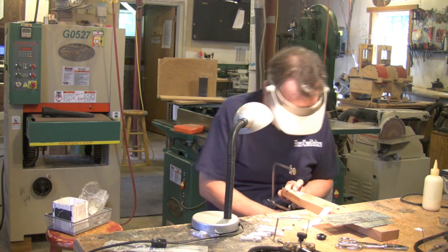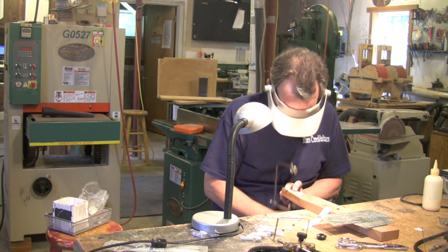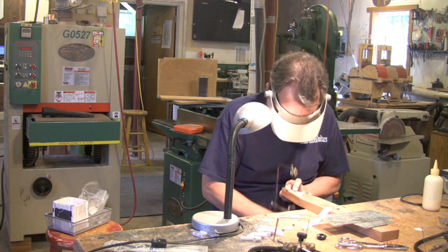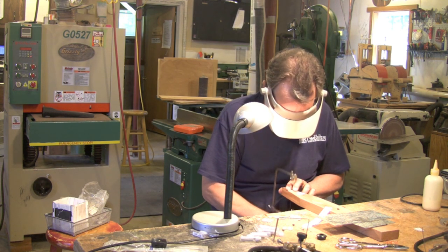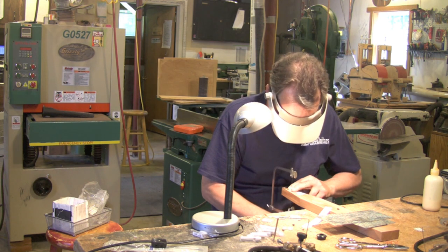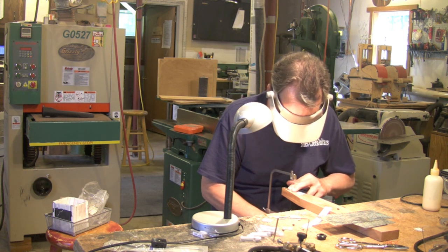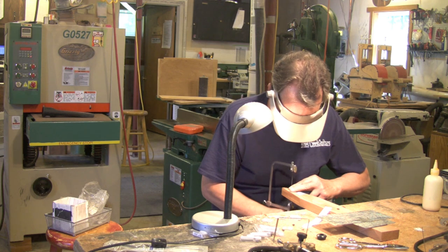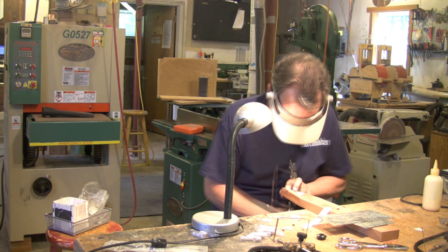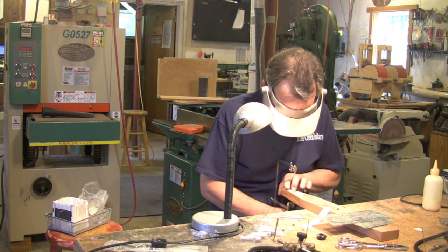If I get too much like this, I'm going to want to tilt my blade. I'm finding a good rhythm. The more you do this, you'll feel the blade working, and if you listen you can hear it cutting. Now there's a straight line — I want to practice a curve. Notice I'm not stopping; my rhythm is about the same. I want to do this so I can turn that around. Sometimes it will grab — when it grabs, take a short stroke and just work it. I want to warm up to the point where I can cut a nice thin piece out.